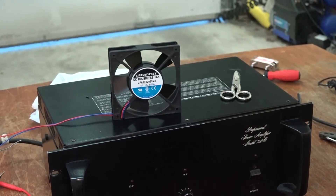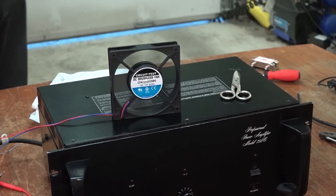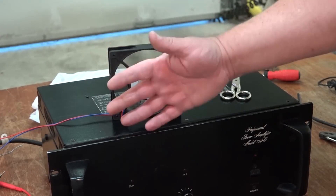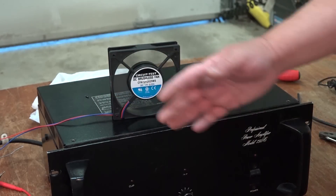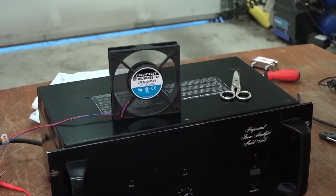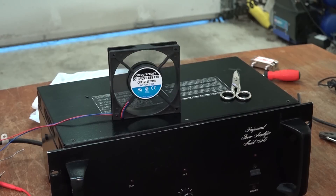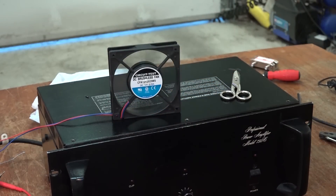I've got a 5-inch DC brushless fan. I'm going to turn this thing on — you'll hear it's nice and quiet. There's barely any sound at all, but it does move a fair bit of air which will keep this unit cool. I'm running this fan on 5 volts, so I'm not running it at full power, because it doesn't need to. So long as we keep air moving through the cabinet we're not going to have a problem with heat, and this thing is putting out a fair bit of air, so that will cool the unit.